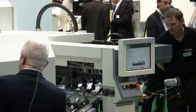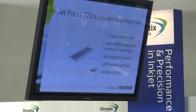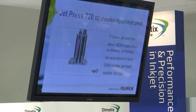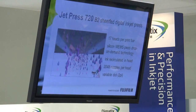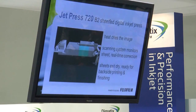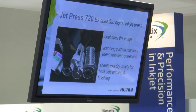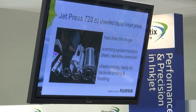Looking at where we inkjet: all four colours go down onto a single imaging cylinder. In the unit we have four print bars, and on each print bar we have 17 individual inkjet heads. We have a silicon wafer with 2,048 individually controlled inkjet nozzles. Our ink is circulated so the pigmentation remains in suspension, and we jet down to a 2 picolitre droplet size. Once we've imaged the sheet, we then have to dry it, so we have a hot air system and an inline quality control scanner. Any issues with the print can be quickly identified and resolved whilst the press is in production.